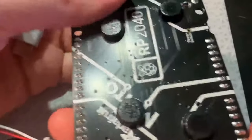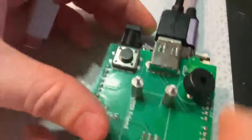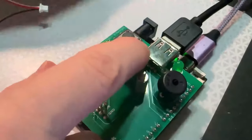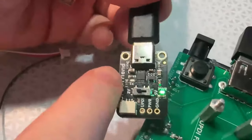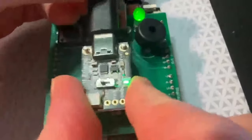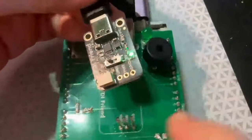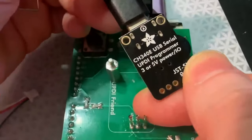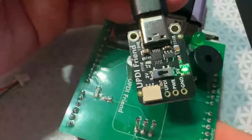I designed a tester for it using an RP2040, because we have native USB serial with bit-banging available on any other pins. I've got a USB host port that enumerates and connects to the onboard USB serial chip, and when I plug it in here it tests that data is going in and out of the UPDI pin correctly. It passes the test — very nice — and it's going to be ready to go in the shop soon.